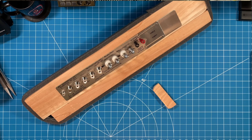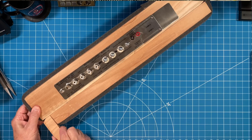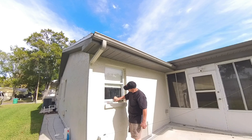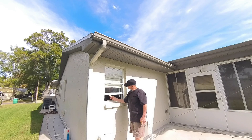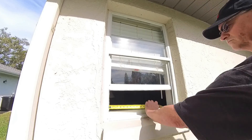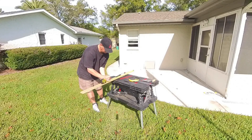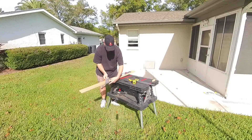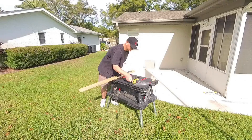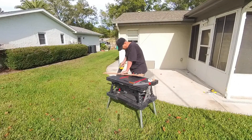I cut a small piece of wood off here because I wanted to test how it would fit in place. Wait — are you telling me the reason I have that gap in the bottom left-hand corner is because I cut off a test piece here? Yep, that's right. So learn from my mistake: if you need that extra strip of leftover wood, don't cut off a test piece. Now that I'm satisfied and know how the wood is going to fit in the track, it's time to measure up and decide how long to cut it. Cut it too long — you can't make it longer if you cut it too short. Make sure you use a square to get a straight line. It's soft wood, so I can just use a small hand saw rather than get out my miter box.